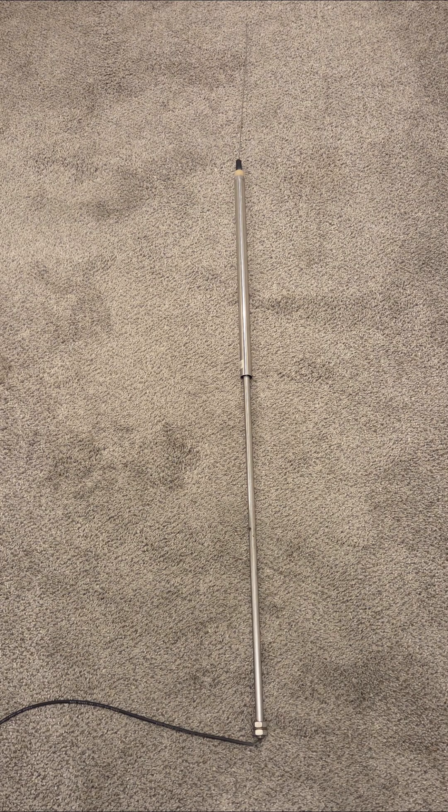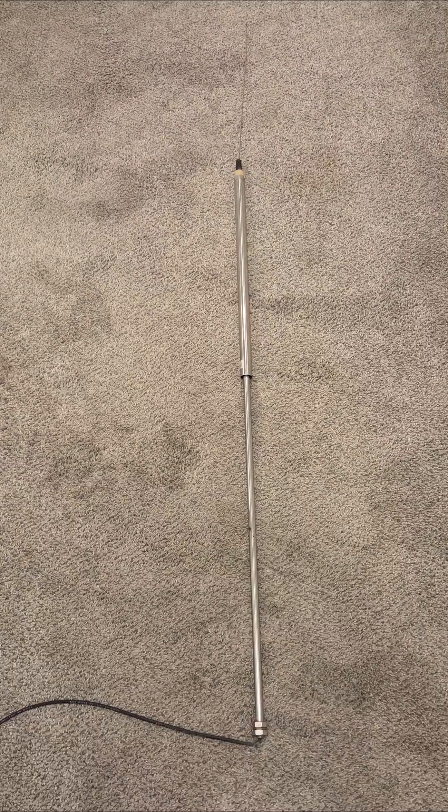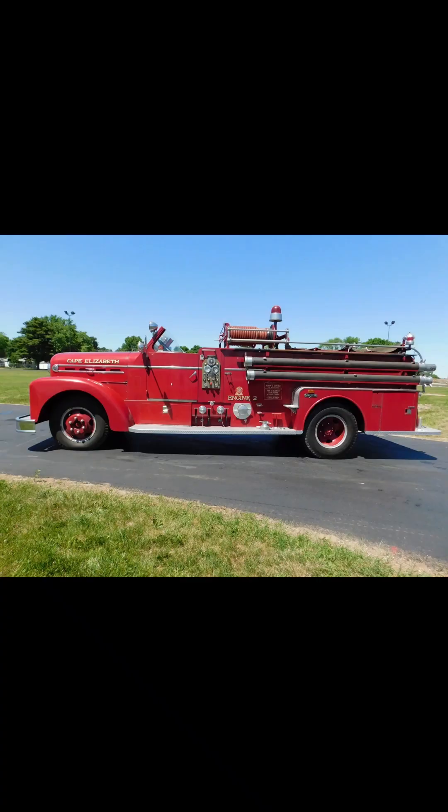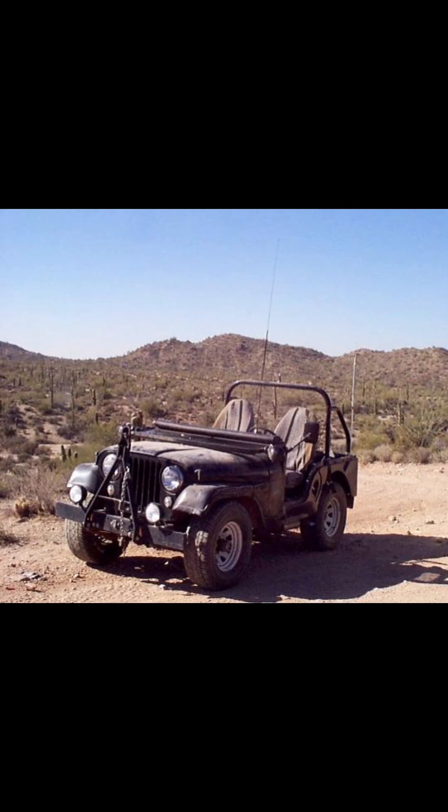This picture is that of a VHF coaxial antenna. It is a center-fed vertical dipole and it is unity gain. They were very common on fire trucks back in the days of open cab fire trucks before they were fully enclosed with jump seats and enclosed cabs. They were also common for various types of road construction equipment or heavy machinery without a roof, and popular for Jeeps and vehicles that didn't have a good counterpoise for a quarter-wave antenna.